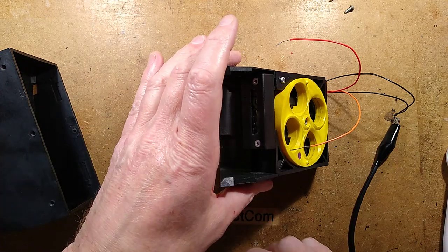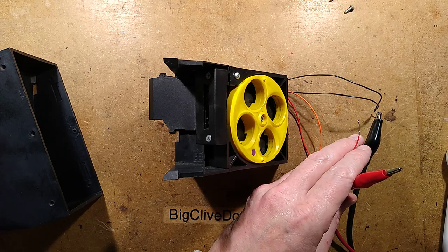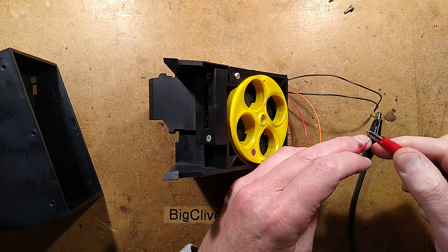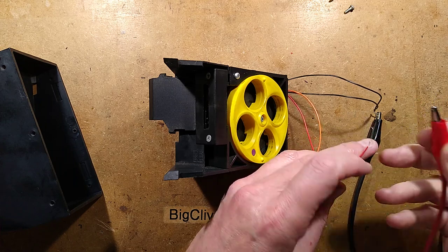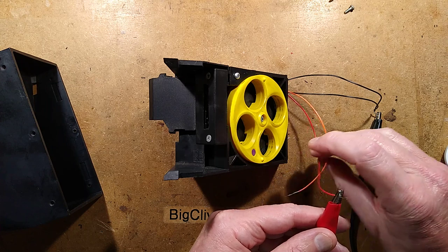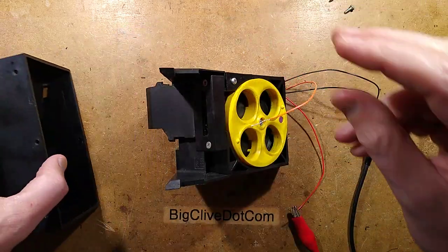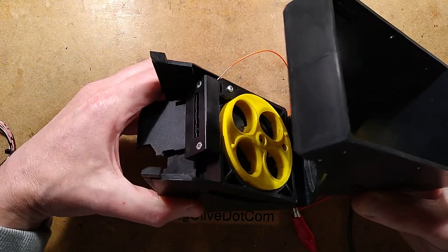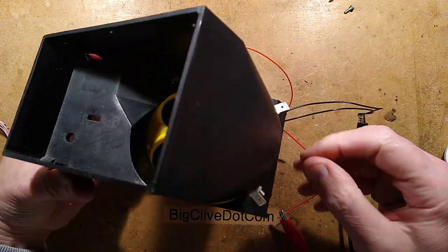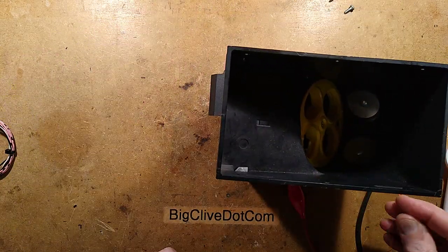Okay, hot wiring in place - I think we're ready to play. I've got just over 20 volt supply here - let's go to the full 24 volts, even 25. When I touch the red wire, that brings in the bypass relay, the DC braking relay, and also the shunt relay that's designed to stop this overpaying out if one of the transistors fails. That has to be left activated, and then when you touch the motor wire it makes quite a lot of noise and spins the hopper motor. Let's put the hopper container back on, hinge it on, clip it down into place, making sure I don't trap that wire.